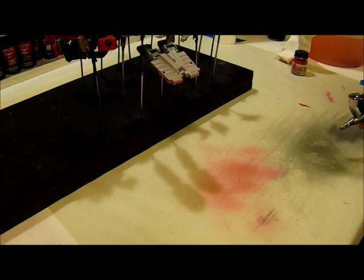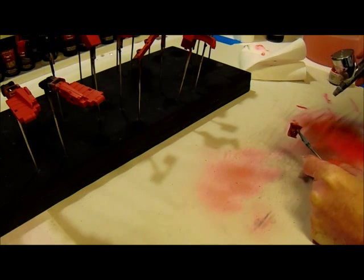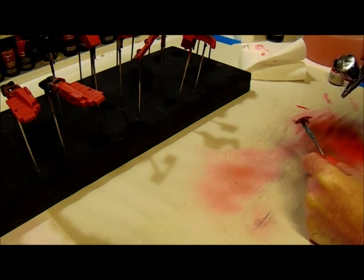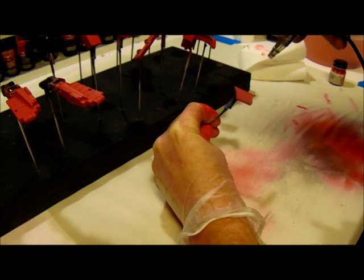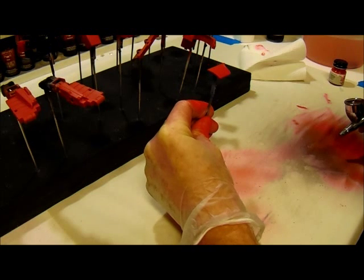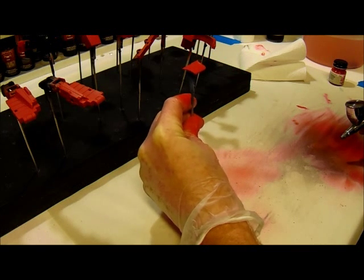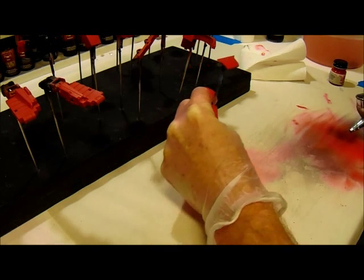I'm going to go ahead and paint all these, then pick it up again at the second coat. Time for coat number two — start with the same piece. This one you can go a little bit heavier, a little more trigger pull, but again, not too wet. You should be able to see by now that this thing is pretty flat and straight. You don't have to go through all that sanding if this isn't the look you're going for, but if it is, that's what's necessary.